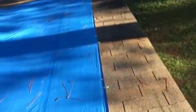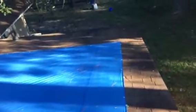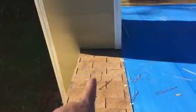That's not good. So the only thing I can see in the way of a repair that needs to be done here to encompass these leaks that are going on here is that this chimney needs to be reflashed, because there's simply nowhere else the water can be coming from. And then obviously we're going to need to replace all of these shingles that have nail holes through them, and then the boots that are not installed properly. So that's what I'm leaning towards right now, because I simply don't see anywhere else that the water can be coming in from.